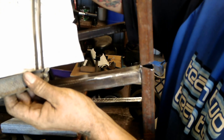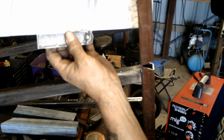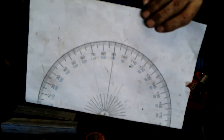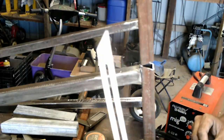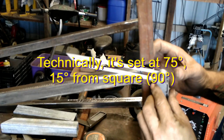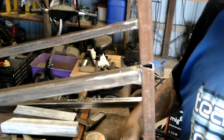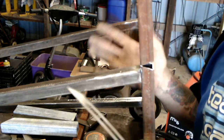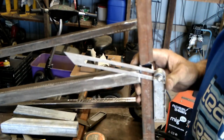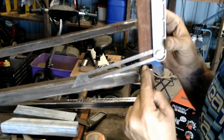So as you just saw, this little bevel is set at 15 degrees. What I did was I found a common mark a little bit behind these posts, measured from the absolute front on both sides so they're both the same. Set this at 15 degrees and then on your square line, scribe it. Turn it over - there's 15 degrees there. So the total included angle is 30 degrees. I hope you can see that I've cut that section out on both legs - this one back here is done too.